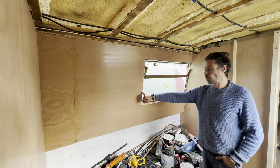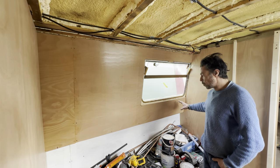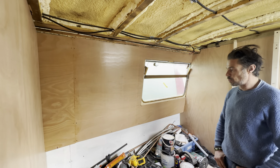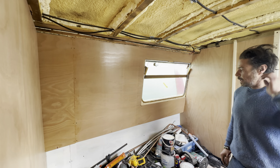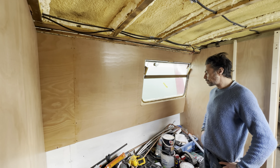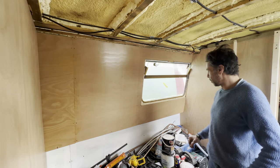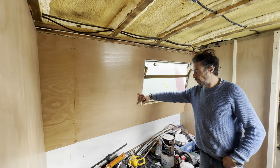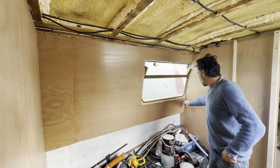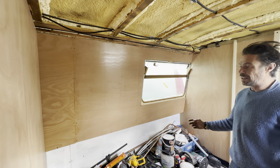In some points it will be going through a 25mm which is only stuck onto the side of the boat, and in other areas it wouldn't be as good - that is just going to be 9mm ply. If there was a lot of weight on that, even with quite a few screws, it's just going to be a little bit vulnerable. I just don't think I'm going to get a strong enough mounting on there. So the way I'm going to do that is to take this board off, which does seem like a bit of a palaver because I've got to take the wall apart. But I've got to take this board off and then weld on some brackets onto the steel wall - probably one there, another one there and another one at the end.